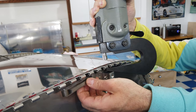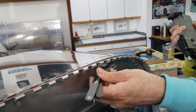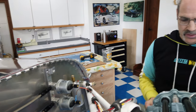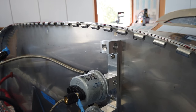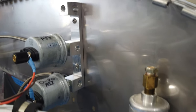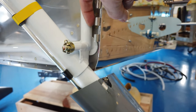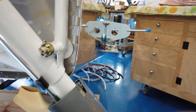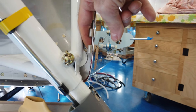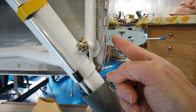Go slow, be very patient. What's nice about the feeler gauge is you can always add or subtract thickness as needed, and that's how I did that. The other place I used that same method was down here - I've got a couple of rivets for this hinge that I had to redo, and you can't get a squeezer in here normally, but using that same method I could use the feeler gauges, drop them down in here, and then get the no-hole yoke in here on top of the feeler gauge and go ahead and set these rivets. That seemed to work out quite well.